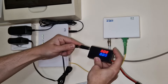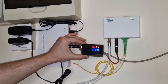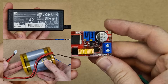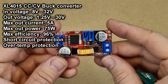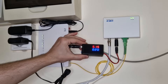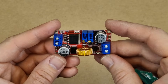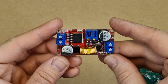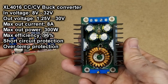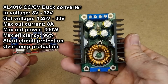Let's start with the simplest output, which is the optical receiver. It needs 5V and only 200mA. So to decrease the voltage from the 18.5V charger or from the 14.6V battery, I will use this constant-current constant-voltage buck converter. It can deliver a maximum output of 5A, so with my tiny 0.2A load the integrated circuit will remain cold. I will still add a heatsink on the IC just to be sure. But if you have a bigger load with more than 1A, I suggest you use a more powerful buck converter — it has a maximum output of 8A and big heatsinks, so with a load of 1 or 2A and passive cooling, the converter will stay cool.